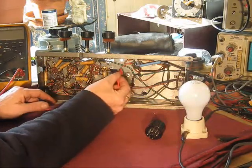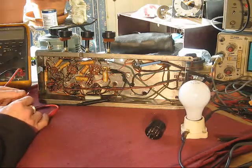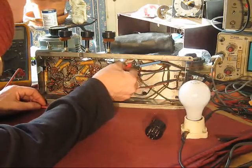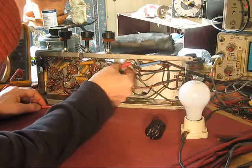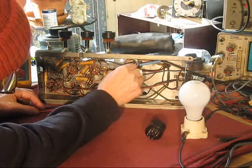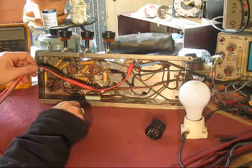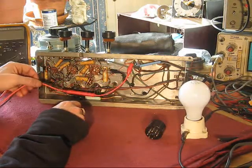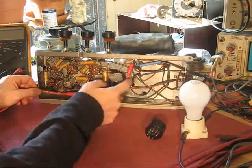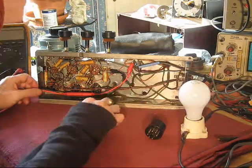That's what this red lead here is. It comes all the way over here to this capacitor. So I don't need to get down into the capacitor, especially. I'll just come right off of pin 8 of the 5Y3 rectifier. And try not to let that slip off of there. Well, we're not drawing current, so it's not going to get hot. This is covering up open, exposed stuff.